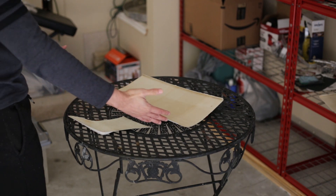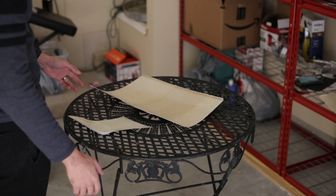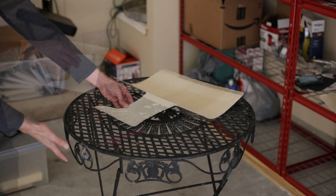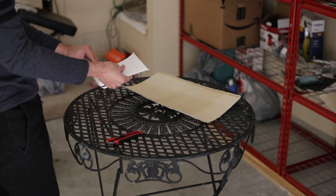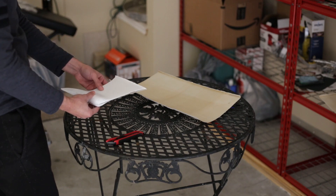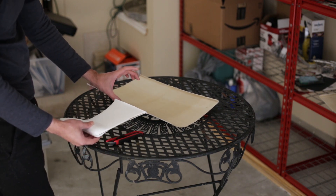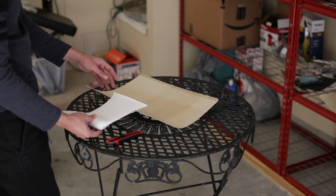The solution for that is increasing the weight or increasing the length of the keel. I cannot increase the weight since I will modify the floating line, so the only solution is increasing the length of the keel — I will double it to compensate for the cubic factor scale. What I am going to do with these two parts is glue them together and make a fake keel, or a decoration keel, to show only the bolt when it is not sailing or when it is being displayed. It will have the real dimension of the normal keel, not the one used by a radio control one. And I am going to design a keel bolt to interchange the decoration keel and the one to use for radio control sailing.